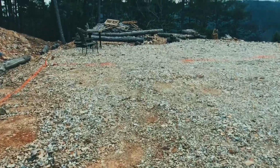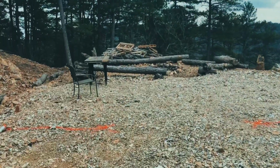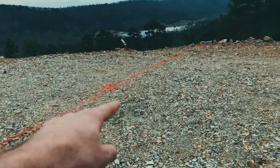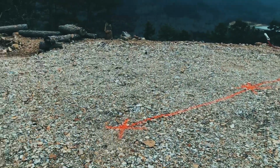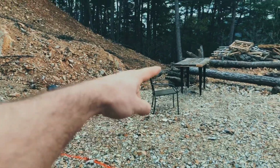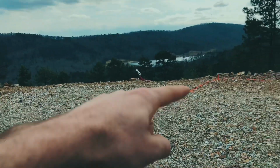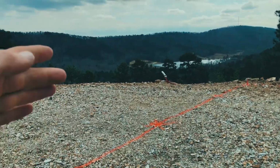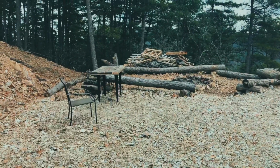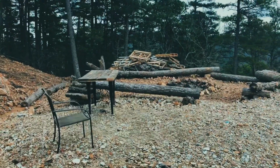So my future plan is to expand on the back side here. And that's one reason I'm going to have this door here, and probably end up putting another roll-up door here, is I'll continue on from here about 24 feet back. Same thing on here, only it angles back this way, so it's going to be caddy cornered and then boxed off. And it'll be a lean-to design with steel trusses as well.